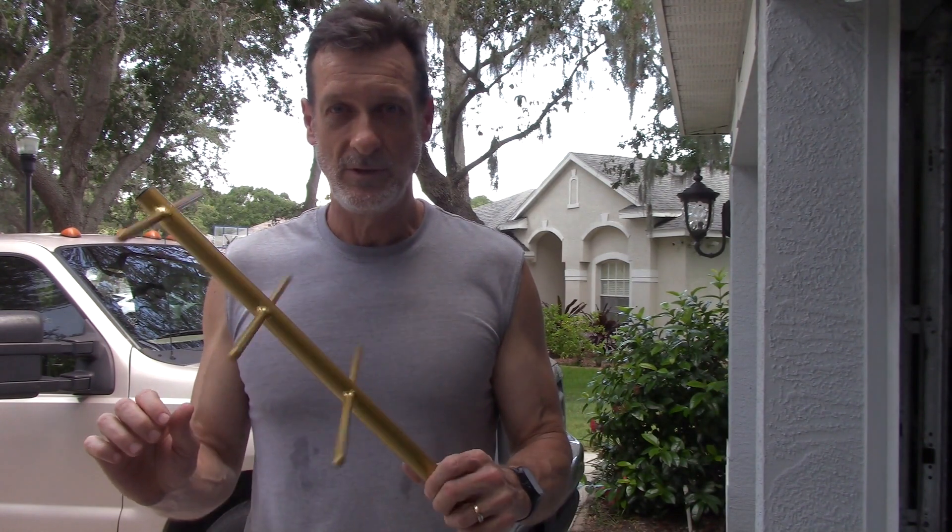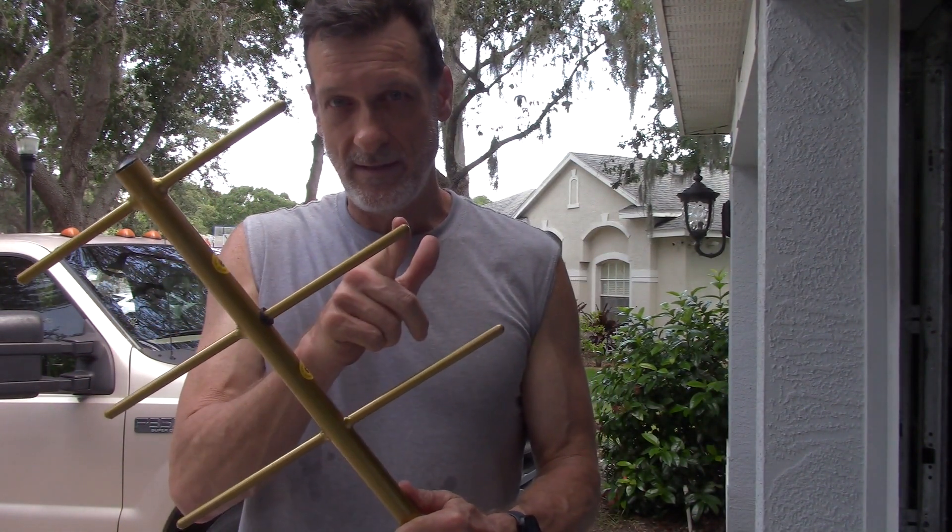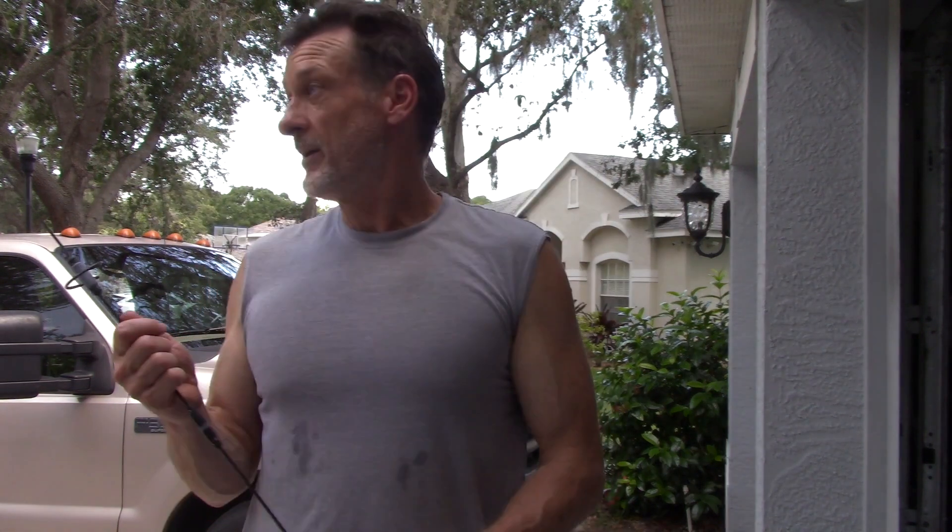As an example, here is a UHF Yagi — this is one side of the antenna, this is the other. You have to look at the other half of the equation. You just can't assume my readings are going to be your readings. All that to say is the readings from a standard SWR meter are different than the VNA. I was using different cables to connect to the SWR meter, so I can't say for sure how different they really are. Different cable connectors may yield different readings. I hope this is somewhat helpful in explaining why some people may get good numbers on this antenna and some may not. Have a good day.